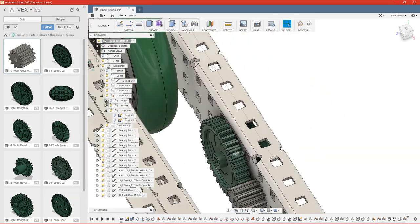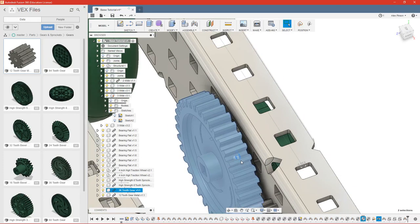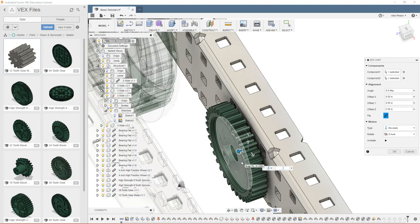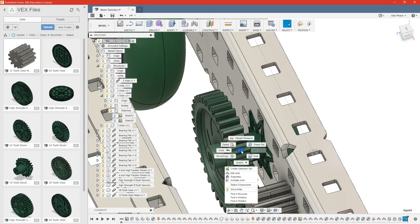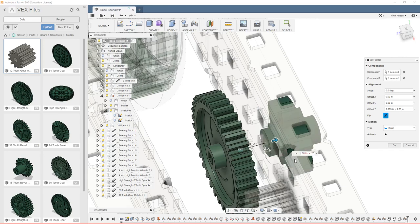So we're going to take our revolute joint, and we can go ahead and edit joint. And we're going to extend that out a quarter inch. Now you'll see that does also offset our rigid joint. So we can edit that. And it's offset 0.063. But remember, we also need to offset it the quarter inch that we just moved it